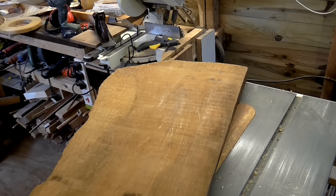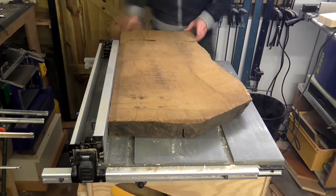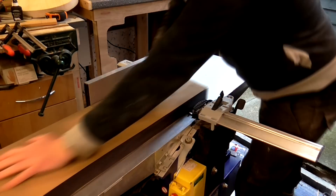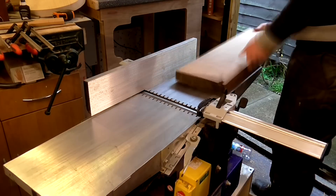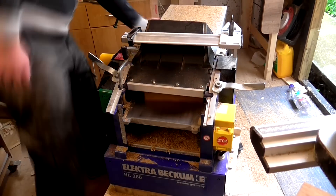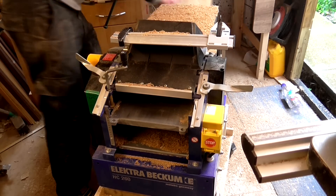I need to figure out how to flatten this and get it to the right thickness. I started by ripping the piece of oak to 250mm on the table saw, making multiple passes as my cheap blade was really struggling with the oak and leaving a lot of burn marks — I'll definitely be investing in a higher quality blade soon. The reason I cut it to 250mm wide was because that was roughly the maximum width my jointer can handle. It took a lot of passes on the jointer to get this piece flat as there was a low point in the centre, but eventually I got there. Then I jointed one of the edges and ran it through the thicknesser, which really struggled with the solid oak. I probably should have waxed the planer bed prior to this too. I just kept making several light passes until I got it to where it needed to be.